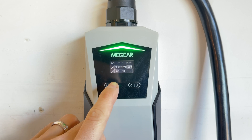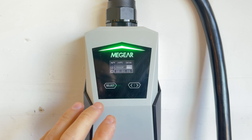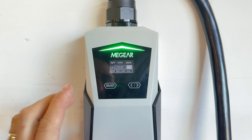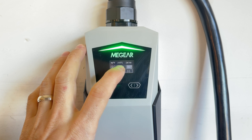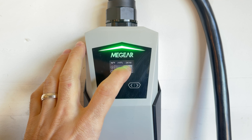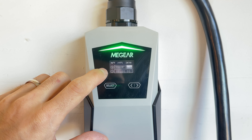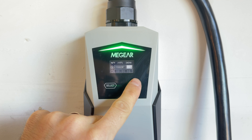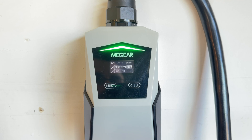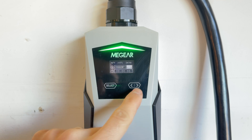The display doesn't play well with my camera but it looks really nice to the naked eye with no lines moving up and down. There are a couple of things you can do with it. We have the temperature — it's at 60°F or about 15°C — and we have 241-242 volts coming in. Up at the top we can change the amperage. Just pressing the button cycles through 12, 16, 24, 32, or 40 amps — as easy as that. On some other devices you have to use a little screw on the side or even take the device off, but here it works with just these two buttons.